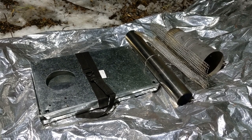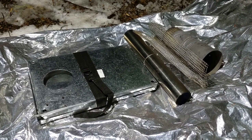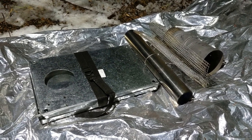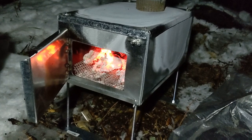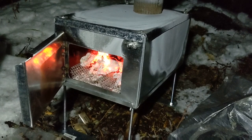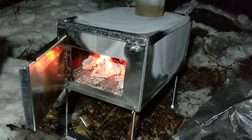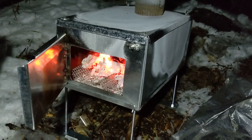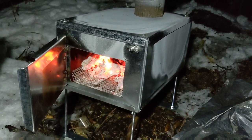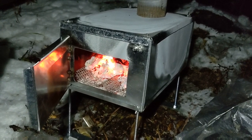Here's a quick look at the pack stove before I put it together. This 12-inch version of the stove with three feet of titanium pipe, a little bit of hardware cloth and a three-inch elbow weighs in at exactly five pounds. I did a couple things different on this stove from the one in the build video — instead of using 14-inch end caps I used 12-inch, so this stove isn't as long. And instead of using the factory eight-inch width, I cut everything down to six inches so it isn't quite as high. Basically did that to save space and weight — this stove is now three and three-quarter pounds.